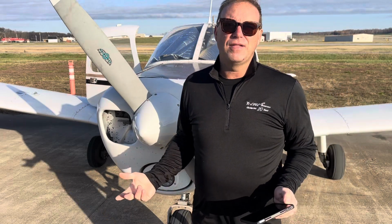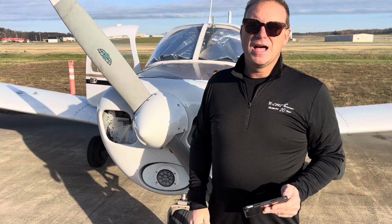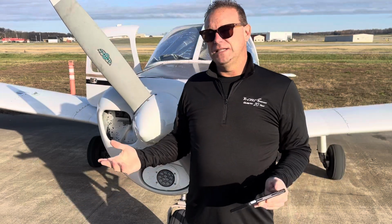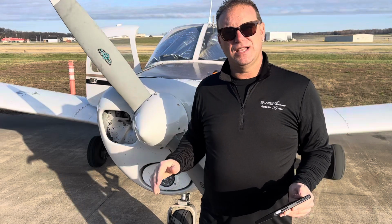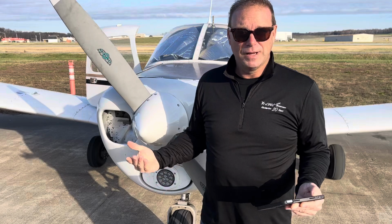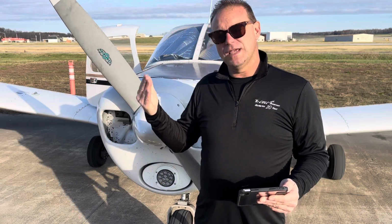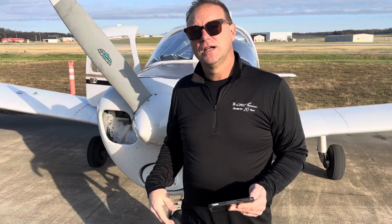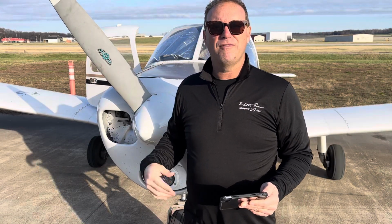How could we have caught that? Well, sometimes you just can't. And what did we do? What do you think we did? Well, it was easy. We just reduced power and started descending. As we came down, temperature started to get colder, which it shouldn't, but temperature inversion. Oil temp got back in line. We found the nearest airport at a low altitude, went there, shut down, popped the oil cooler plate off, put it back, and took right back off and went on.